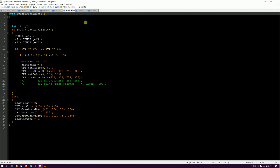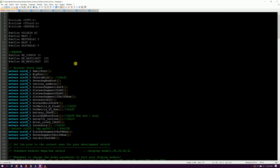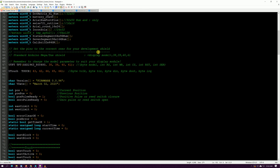East is doing the same thing as west, but for the east direction, and we're counting back the other way. You're also going to want to check your east and west limits: if your west limit is set for 400 counts and we're counting up and hit 400, we want to stop, throw an error, and shut everything down — say we've hit the west limit or east limit.